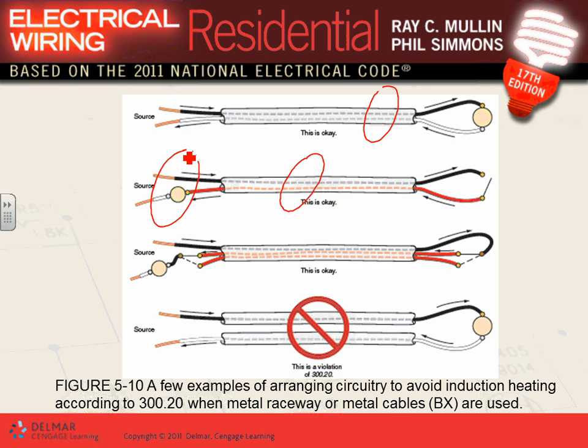Three-way switches. Can you guys see, when you have a three-way switch, you have to have two travelers. We'll talk about this one in a second. You have to have two travelers. Can you guys see that? Two travelers tied to two different terminals and one common coming in. So you have three conductors going into the cable.